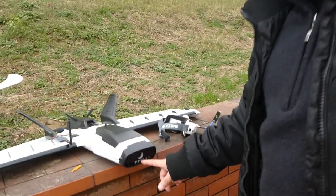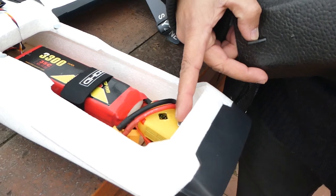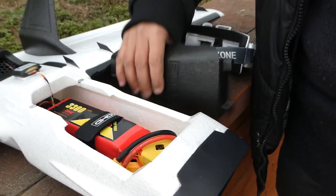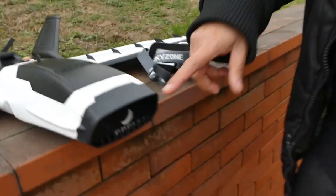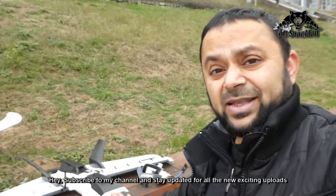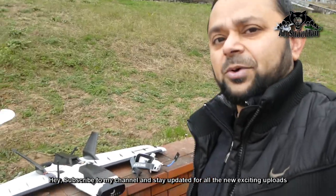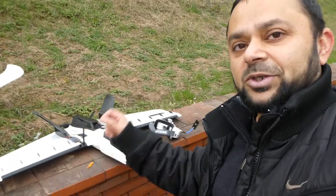I can actually take the audio video out feed from the Q6 camera like I used to do when I put it on the Mini Talon. I didn't have another camera. I just take the AV feed out from the Q6, and that means I don't have to use another camera. But hey, for now I'm just gonna keep it this way, because this way I can swap the HD cameras anytime I want. So next, first thing, change the video transmitter to 1 watt.